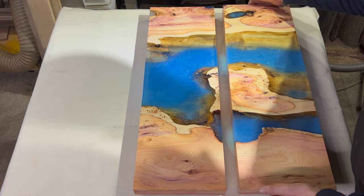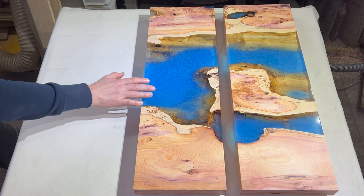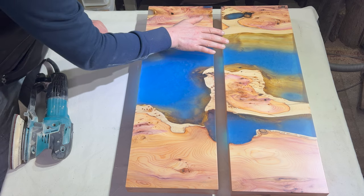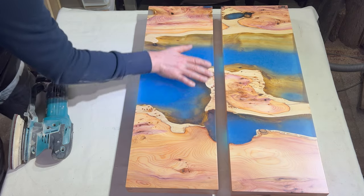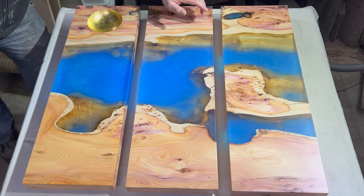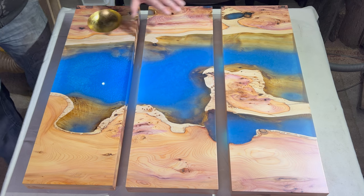Here's the other piece — that'll go somewhere about there when it's on the wall. And the other one is back from gilding shortly. In the interim, I'm going to do one at 600 and the other one at 3000 and let's have a look at them. 600 grit finish. 3000 grit finish — see that's not quite so shiny, more a matte finish. The wood's a little bit shinier than the resin. Much preferred. 600 grit — no. 3000 — yes. And the one with the gilded bowl is back from Lenore — high gloss with some finger marks on it. I prefer the 3000. It's my preference, it's my work — do let me know your favourite in the comments. Right now, I'm going to finish all of these to 3000.